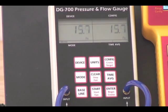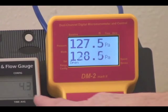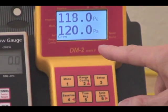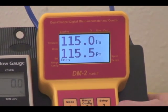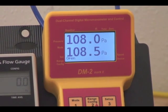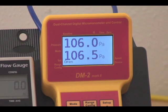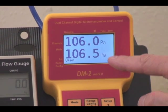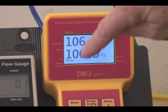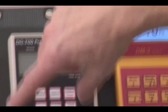This gauge is performing very nicely, as is this one — we have almost exactly the same reading between each channel. This one has dropped all the way to the end, so we can say this check is complete. The AutoZero can be turned off and the reading will stay more or less frozen at one pressure, which tells us that the gauge is not leaking. We're only off about half a Pascal — less than half of 1%.